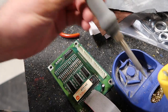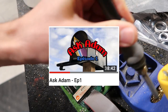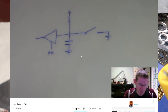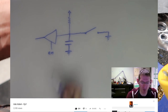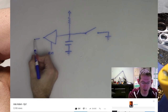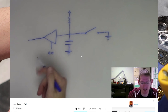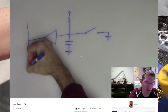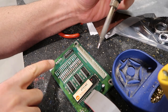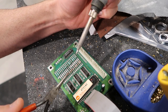Adam from OneCircuit just uploaded his first Q&A video — I just watched it. He did this Q&A video and the first question was exactly this problem. He talks about a switch always being stuck on even if it's disconnected, and the player keeps moving in one direction even though all controls are disconnected. He suspected it would be a little capacitor that shorted the ground. I figured if the capacitor was bad it would just be an open circuit, but it was the same capacitor.